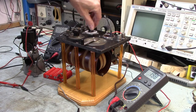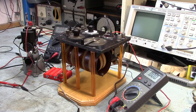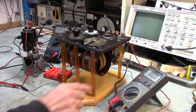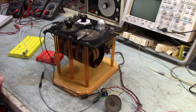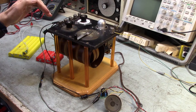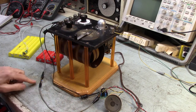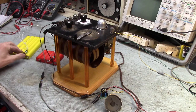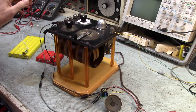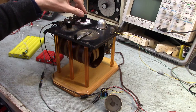So the next thing is to actually hook up an antenna and headphones and see what this guy does. I've got everybody all wired up and added a little cheap amplifier that's capacitively coupled so you can hear it. You hear a bit of a pop when the high-voltage power is applied to the headphones.